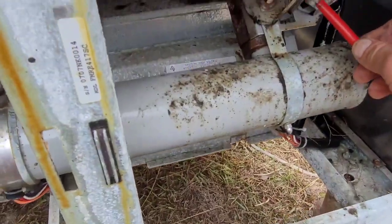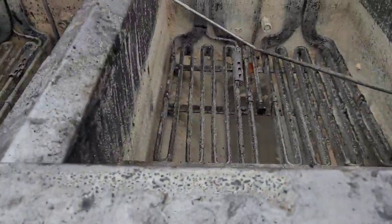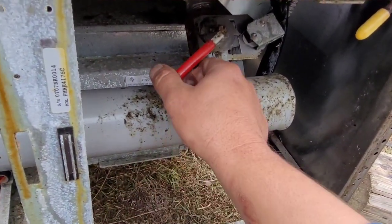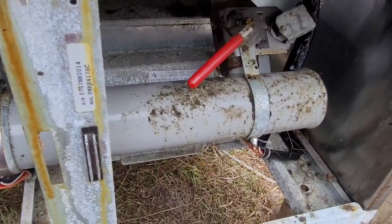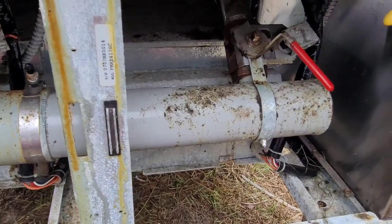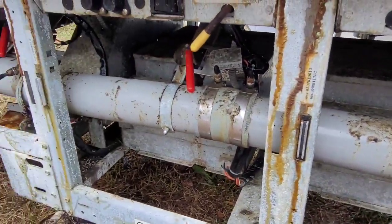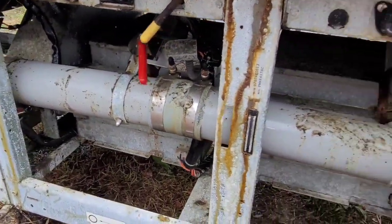One of the common big mistakes while filtering: sometimes when they drain the oil and open the valve, once there's no oil left in the pot they just close the drain — and that's wrong. When you are filtering, you need to leave the drain open for at least one to two minutes, because there is always debris in the drain spouts or pipes.